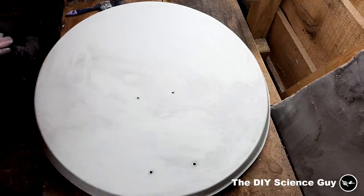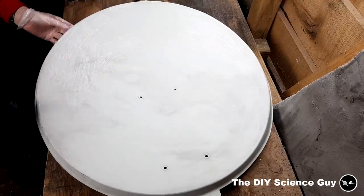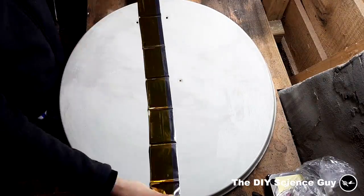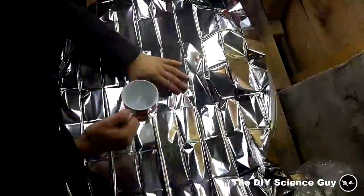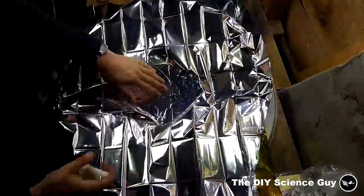Okay, I started by degreasing the whole surface with thinner. And then I applied a thin coat of my special hot glue paint. Once applied, I let it dry for 2 days. I earlier made a video of how to make this glue paint, so I will put a link in the description. I'm using an emergency blanket as the reflector surface. Then I poured on some hot water to slightly melt the hot glue layer so I could rub the foil onto the satellite dish.